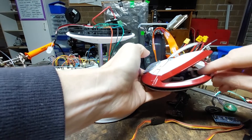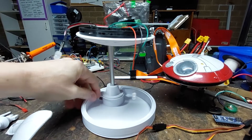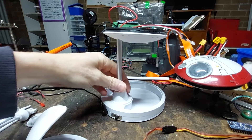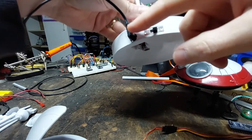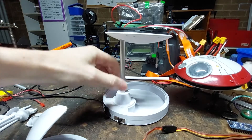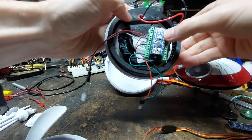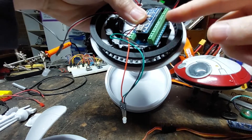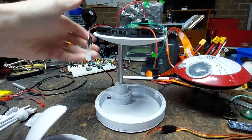For those that don't know how to solder, I'll turn Lola off. I've tried to design it so that everything on this at the moment — version 2 — is not soldered. I have it set up that the cable is run up through the base. There's some cables in the bottom here connected to the switch for the five volts, a DC plug coming in off a power wall wart or a DC converter. And for those that can't solder, you can have an Arduino Nano plugged into a breakout screw terminal board — you just use a standard screwdriver to do the terminals up and it bites in and holds. Nothing on here is soldered at the moment.